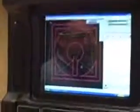Okay, so now we have the 3 patterns all mapped out and ready to go. What we need to do now is configure the OMAX Make software so that it knows what it needs to do. And so what we're going to do here is go into our Change Path Setup dialog and navigate our way to the folder where this is at, and go ahead and select the first file, which is our front end of the jet.